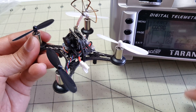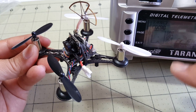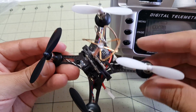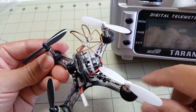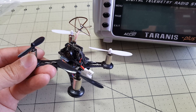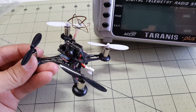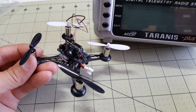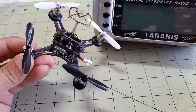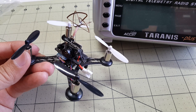They only have it set for five channels, but you can reconfigure additional things in Cleanflight if you know how. I already did the bind to the Taranis - pretty simple, just plug in the battery while holding down the bind button just like any other FrSky receiver, then go into your model and hit bind, and it bound just fine. This is just the initial look at the QX90 - I'll have flight test video up in a day or two. Stay tuned to my channel, I'll talk to you later.